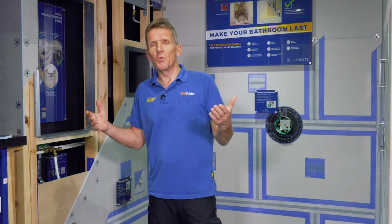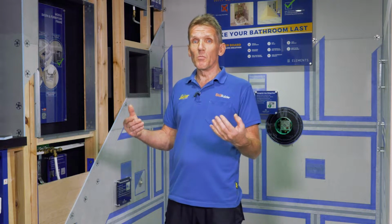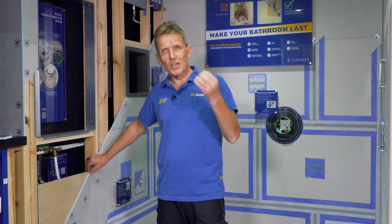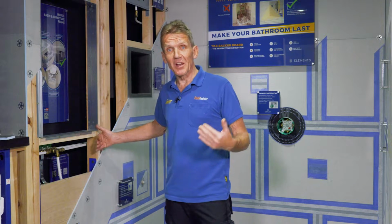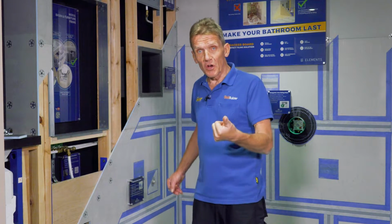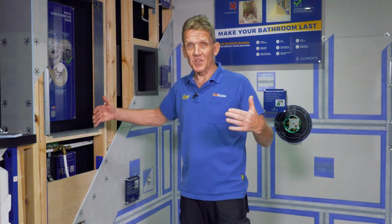Now, I've been a bit of a voice in the wilderness, if you like, because over that time, I've been telling people that they've got to use more suitable materials for use in constructing a wet room and tiling onto. Now, I've got a bit of backing now because the British standard has recently been changed to say that you must now produce a waterproof, what they call tanked system, whenever you're tiling in a wet area. Not only that, but they've said that plasterboard is unsuitable unless it's been tanked, and also you can no longer use timber to tile onto on walls. Now, that's a significant change, and that means that it's opened the door for a much better system.